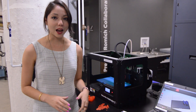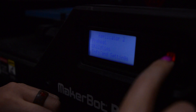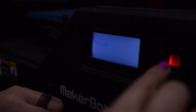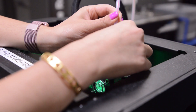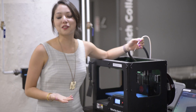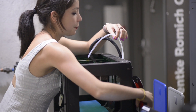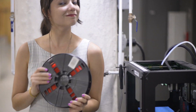When you're done, be sure to put everything back where you found it and return your roll of filament. To unload the filament, go into Utilities, Change Filament, then Unload. Unloading is very simple — first pull the guide tube off and then gently ease the filament from the motor. Now roll the filament back onto its roll and remove it from the holder. And we're done.